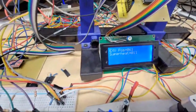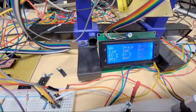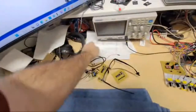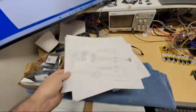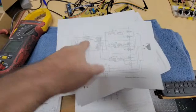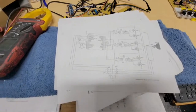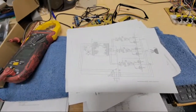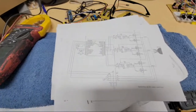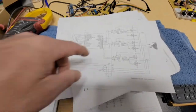Yeah, I wish I could run the inverter compressor instead of that fixed speed rotary I put in there. I do have stuff to make it. It's going to be another hurdle for me to learn and do, but I should be able to do it. Somebody else actually already has it laid out. It's using the same processor. I just have to adapt it to my XC8 code, which is really similar. And now I know enough about it that I can just look at what the other code was and how mine works and just make the adjustments.